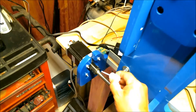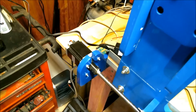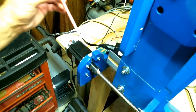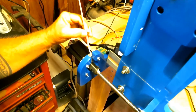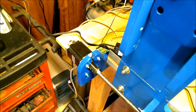This is basically simplicity itself. What you do is take the brush loaded with whiteout and draw a line straight up on the face of the coupler, then add a line onto the lead screw itself. I had to re-dip the brush because I didn't have enough on there. Doing the motor end of the coupler is a little bit different — some tight quarters in there, so I used a standard model paintbrush. I dipped it into the whiteout bottle and just drew my line on the motor shaft and right up on the face of the coupler. That's it. Let it dry and you're all set.